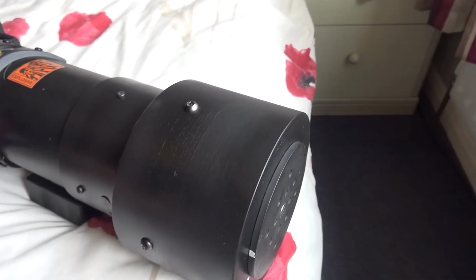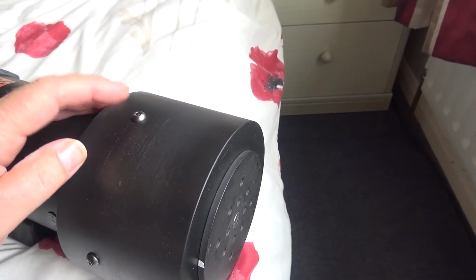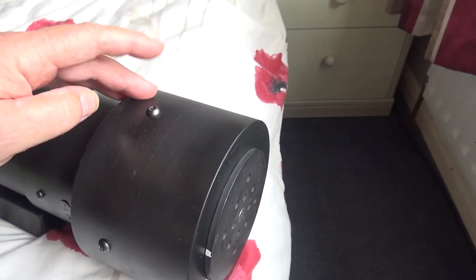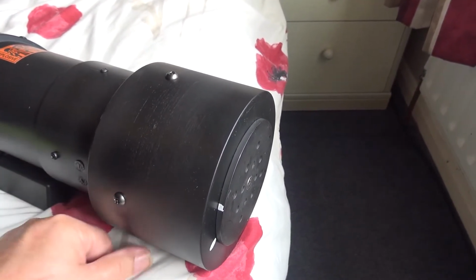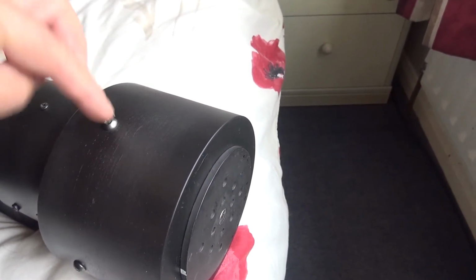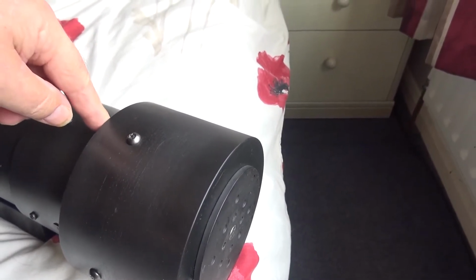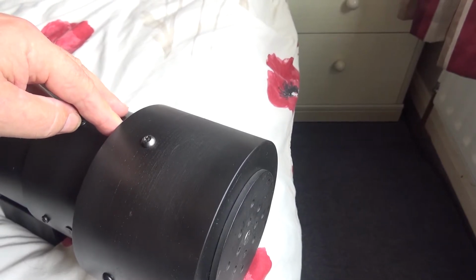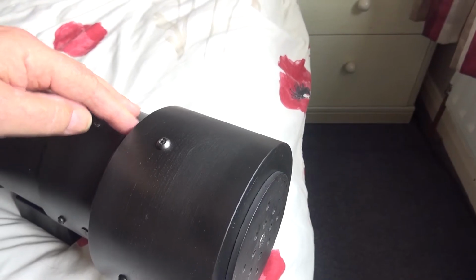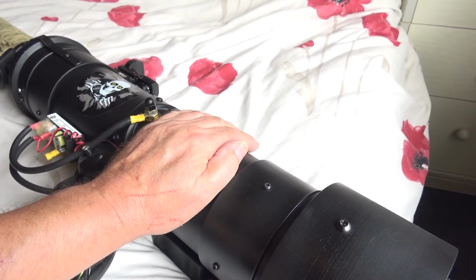And as you can see, what I've done on a 90-degree PCD, I've put the stainless steel 30mm security screws at 45 degrees to each other. There's one underneath and there's one on the other side here. They go through the adapter and through into the breech, which I think was 10mm wall thickness, which I double lined. So this is as strong as anything. That's never going to be any problem.